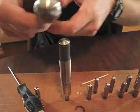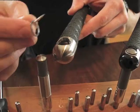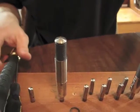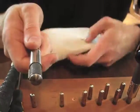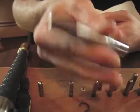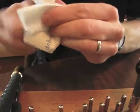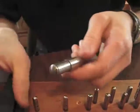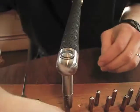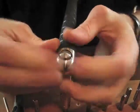So here's the grease. Also note that the 200 series has a small bearing in there, or a spacer really — just don't lose that. If your hammer is forcing grease out on your hands, just remove the extension — that's this piece here. Use a paper towel and work it off, then put it back in. Make sure the bearing is seated.